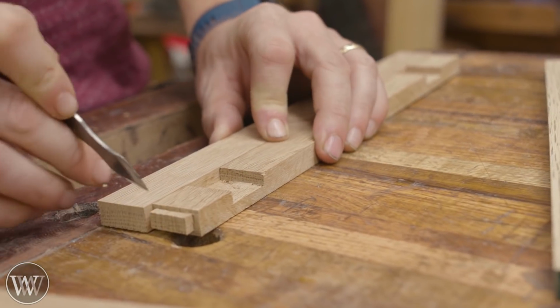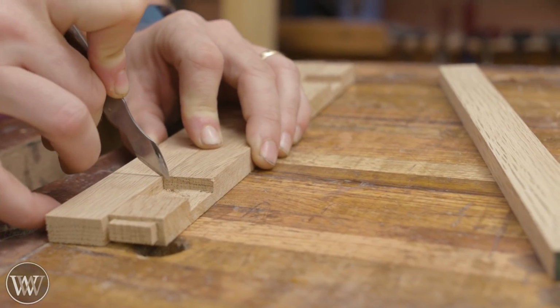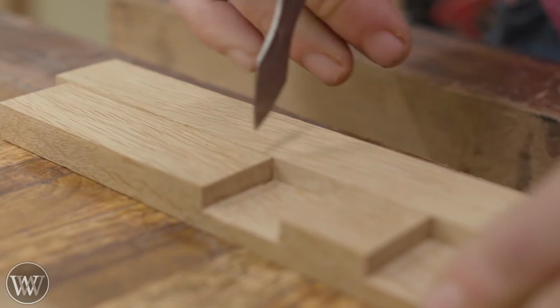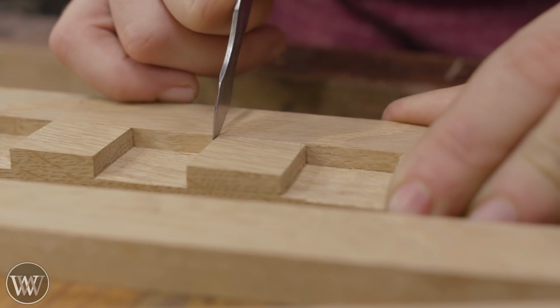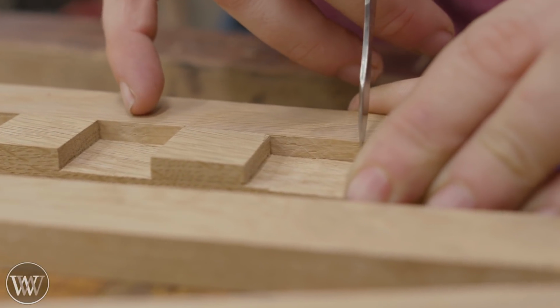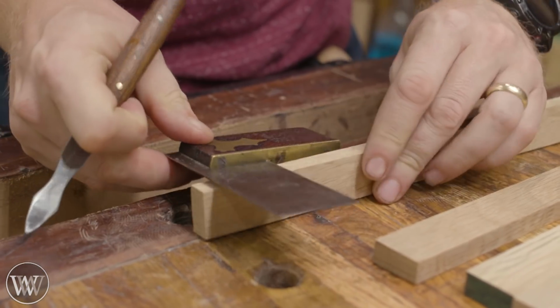Now that we have 40 of these sticks to length, we need to actually start laying out all of the half lap marks. And I'm just going to be marking one side of each of the half lap with my story stick. So I made one ahead of time and I can make them all match that. I'm only going to mark 1/2 of the half lap with that. And that will allow me to mark the other half with the exact width of the actual stick.